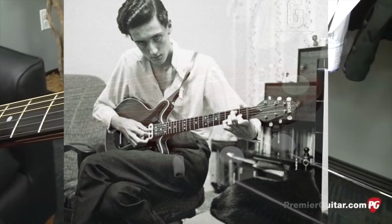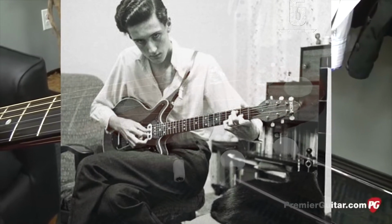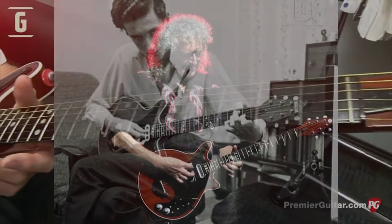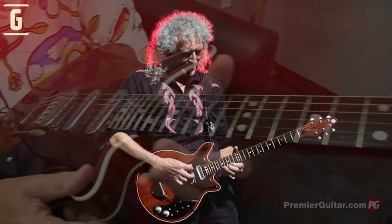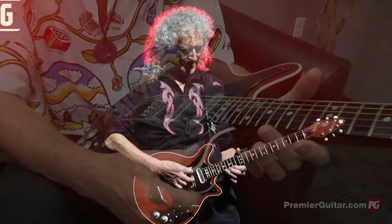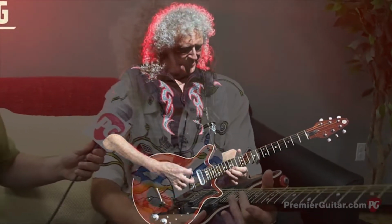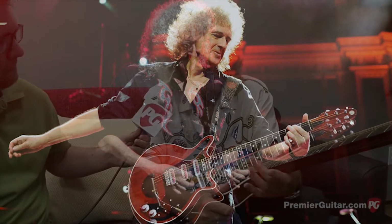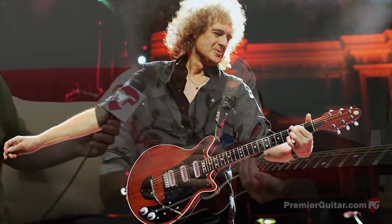Brian and Harold spent a lot of time on the tremolo system. They used the neck of the guitar in progress to create a tremolo test bed. The pair went through 3 revisions before settling on the final design. Friction is eliminated everywhere possible. The entire tremolo assembly rides on a knife edge, which Brian and Harold hardened using case-hardening compound over the kitchen stove. The strings ride in roller saddles.